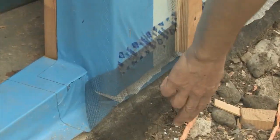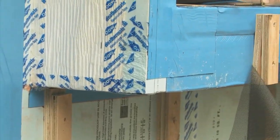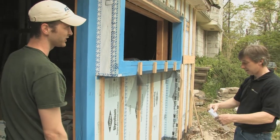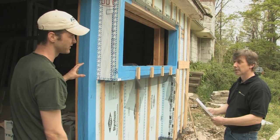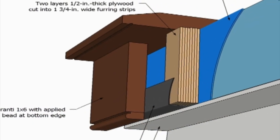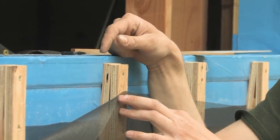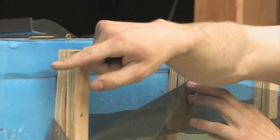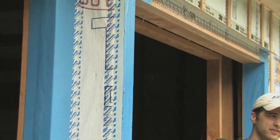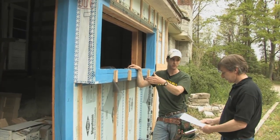Over here we have the insect screen again, as on the other side, which will be rolled. We also have insect screen just below the window so that water draining out can get out and bugs can't get in. This is a spot where you need to tap into your inner perfectionist and really go the extra mile. There's a solid board that carries across the whole front of the building with the windowsill coming out over the top. Since we have a vent down here - because even the smallest spots need ventilation - and there's no room for a vent at the top because of where the sill is, we left these a half inch down so air can circulate over to the full-height channels on the sides and still be fully ventilated. Even small spots need an intake and exhaust, or horizontal movement that connects to intake and exhaust.